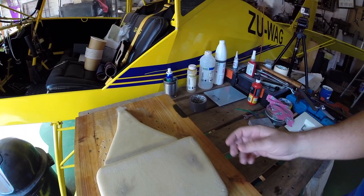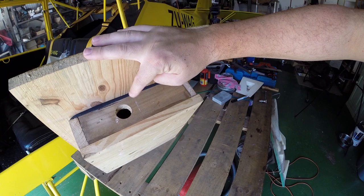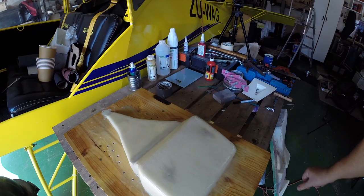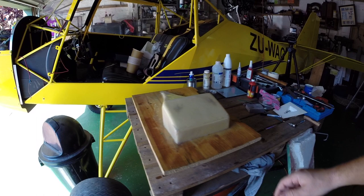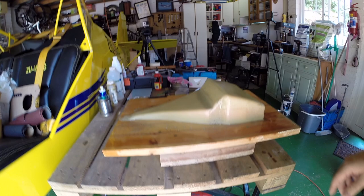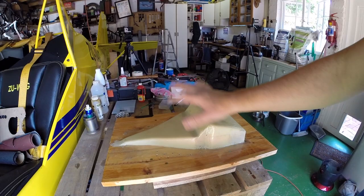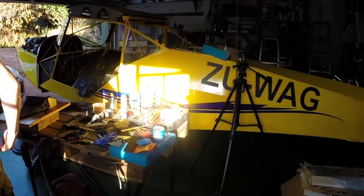So this has been placed on a vacuum box. We stick a vacuum cleaner nozzle in there. Suck a vacuum through these holes, and the whole idea is this is going to be my attempt at vacuum molding, since I don't have access to a vacuum pump at this stage of the game. So we're going to polish this up. It's going to need about four layers of polish, and then we're going to have to polish it up, rub it down, and then I guess one or two more layers before we throw the carbon on it and give it a bash.